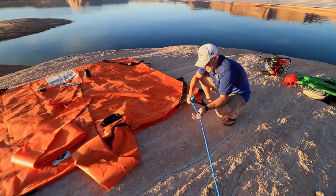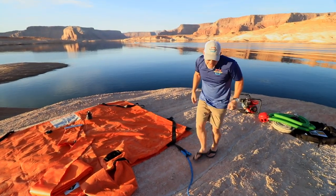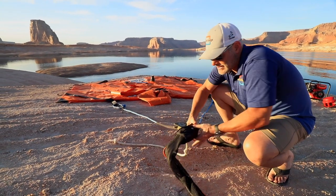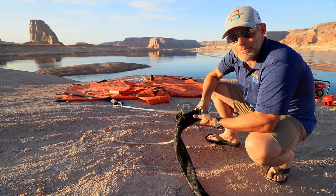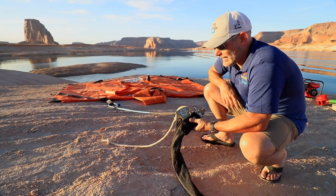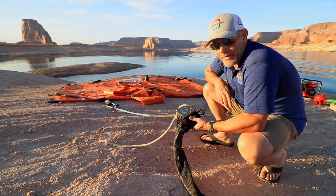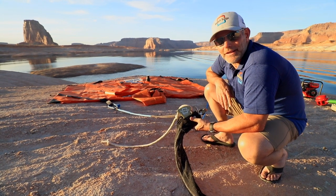I have a harness line right here. I connect my harness line to my harness loop with these really strong soft shackles. Now the last thing I want to show you is really cool. If I just had a rope, I would tie my houseboat off right here on my harness line. But if you've got tight rope, this is our game-changing system for keeping your lines tight. This little device allows me to get my anchor lines four times tighter than I could without it — so if I could pull 100 pounds by myself, now I could pull 400 pounds. This is the easiest way to keep your lines tight, and keeping lines tight is a quick way to safety on the houseboat.